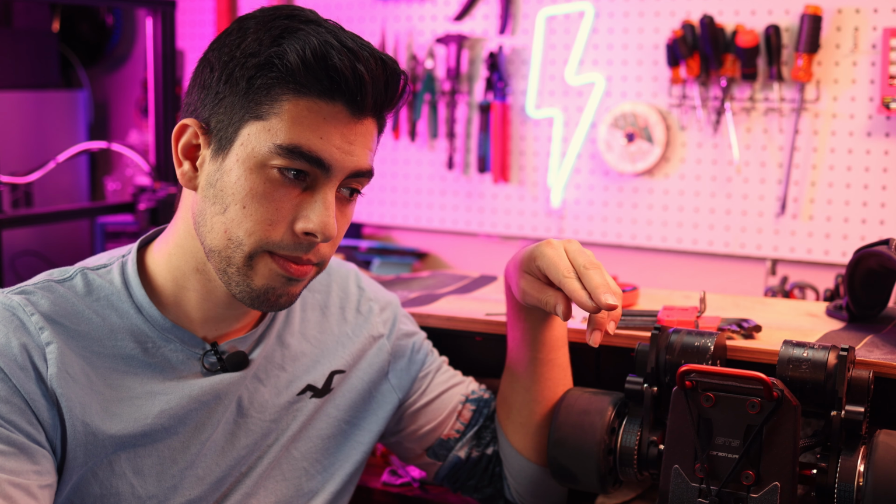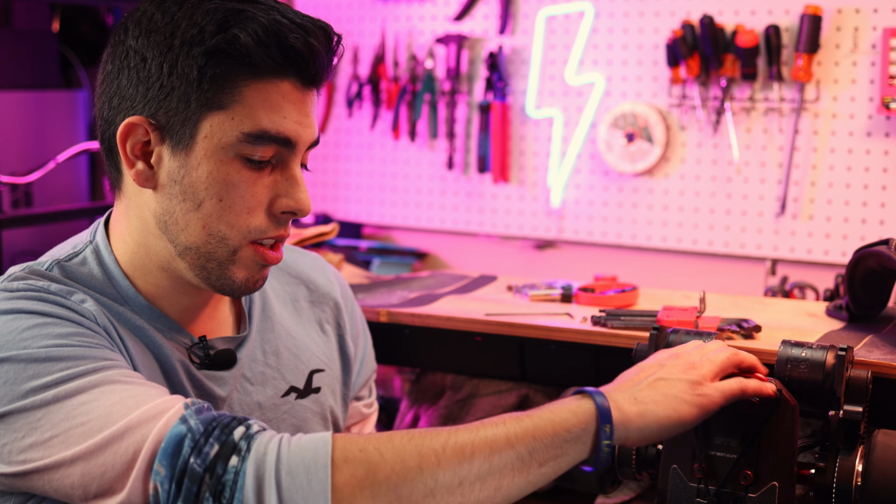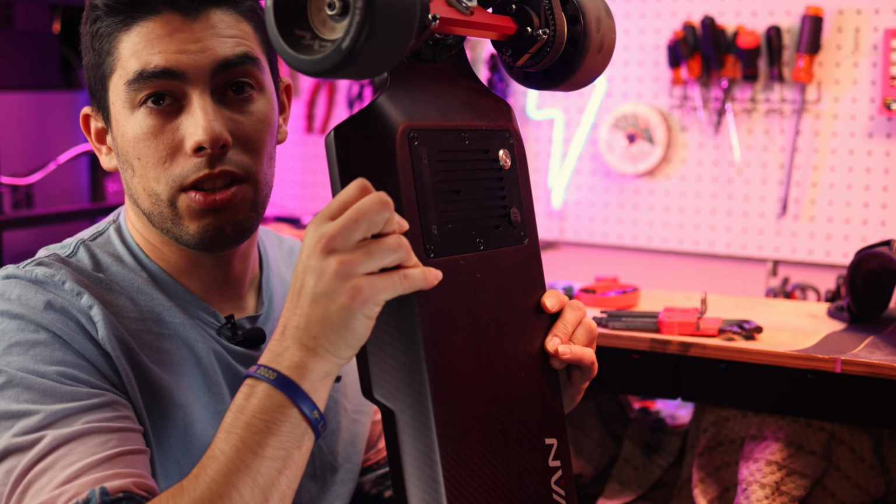Basically, you can use only one pin to turn it on, but it needs the activation of the other pin to turn it off, just because of the way that it's wired. So basically, I had to find a 5-pin switch that was short enough and the right diameter to fit inside of the small amount of space inside of this skinny little deck.